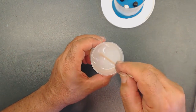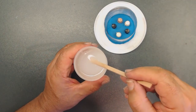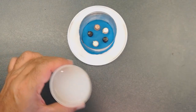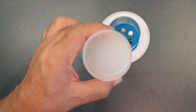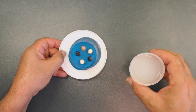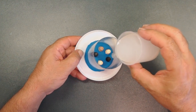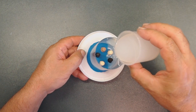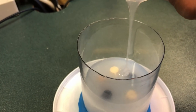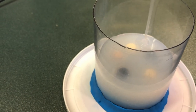I want the silicone rubber to cover all the knobs and have about a quarter inch over them. Let it sit for a minute so any bubbles come to the surface. Then tilt the container a little bit and pour just a little at a time into one corner, letting it flow down and over everything. If it goes over a quarter inch above the knobs, you're in good shape. Let this mold sit for several hours; when you touch it and it's totally hard, it's dry.